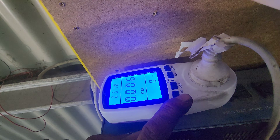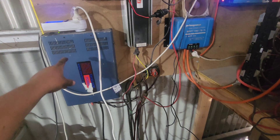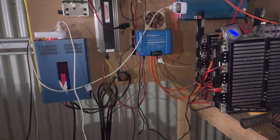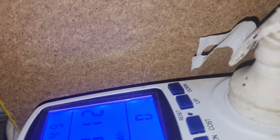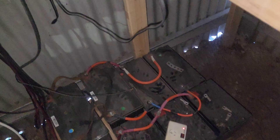We're using 113 watts right now, so let's run some stuff and go until the inverter is beeping. The last video you'll see is that beeping and we'll have a cumulative number to see how much power we get. There's the noise — 11.7 volts, bounced back. How did we go? Four kilowatt hours — 4.12 kilowatt hours is what we got out of that little pile of batteries.